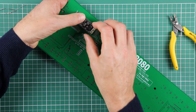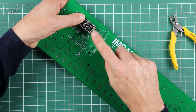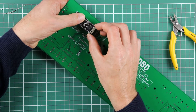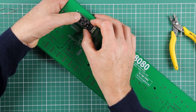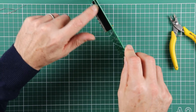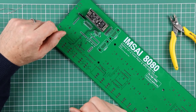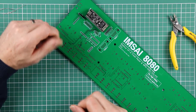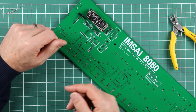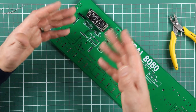When you're pushing down on the ESP32, don't press on the Wi-Fi antenna because you might bend it — I have broken one off and they're quite fiddly to try and solder back on successfully. Just pushing down around the edges will seat the ESP32 in those female connectors, and now we're ready to take it off and hook it up to a PC over USB and have a look at the logs presented on the console to make sure those components are connected properly. I'll cover that in another video.